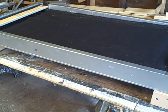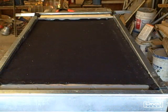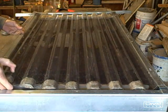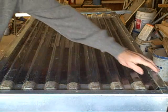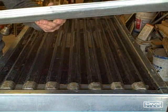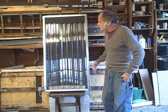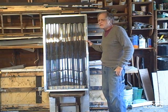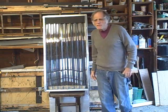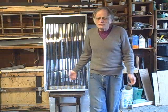All these screws do is hold the frame for the polyester felt. If you use sun-tough glazing, you're going to have to find some way of sealing off the indentations on the glazing — you could use wiggle strips, that's probably the best thing to do. These side supports are actually made from steel stud slots: if you take a steel stud slot and rip it in half, you'll have these angle irons, or you can buy angle irons ready-made. You can also use aluminum soffits, aluminum flashing, aluminum screen, or even a nylon screen as an absorber plate.